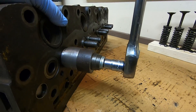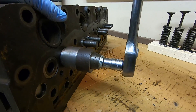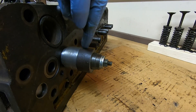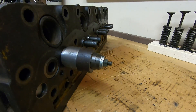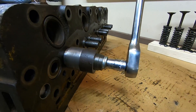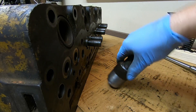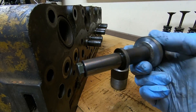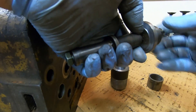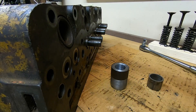Run the nut until hand tight, make sure everything is well aligned, and now just start cranking pressure down. This is essentially a puller that keeps all the pulling force isolated right around that guide — you're not going to stress the head or inflict any damage. Just about ready to break loose — there we go. It's going a lot easier now. Keep cranking down on that nut until it pulls the guide up into the center of the sleeve, then take it out. There is the guide. Then remove all the pulling adapters, get the bolt out, and continue on down the line.